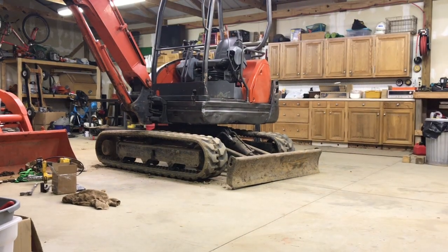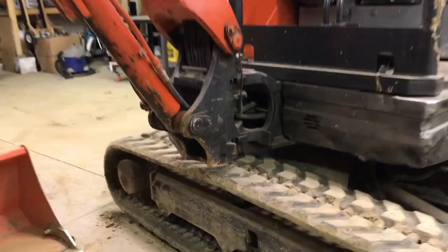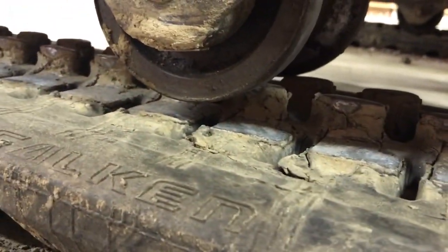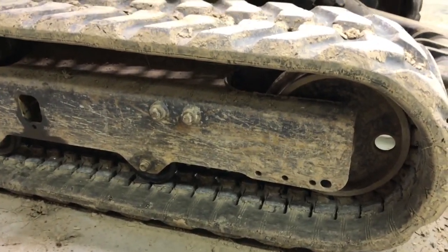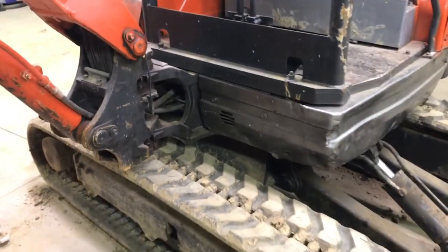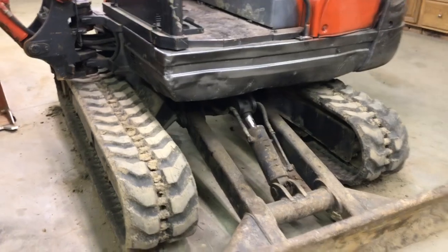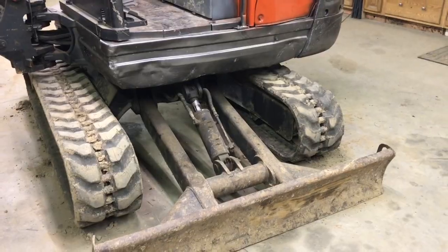Also that last top roller went in there, got the track tensioned up again with that infinity sign over the top roller, and proper clearance in there. Everything looks good on this. Spins good. I'm gonna take it and track it, and I'm hoping for the best. Before, this thing was very loud, obnoxiously loud as it tracked. A lot of creaking, grinding, everything else. So I'll get it spun around here and get a video as I track forward on it.